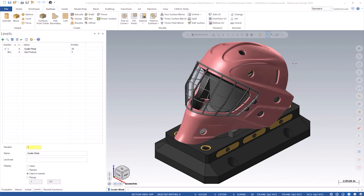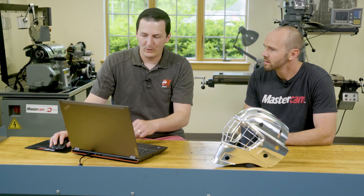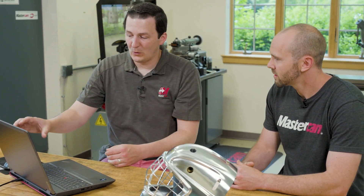For example, the biggest difficulty with mesh parts is the fact that they're essentially just one body. So when you pick this as your drive surface, the whole thing is your drive surface, so you may need to trim it and cut it up a little bit. That's no different here — I had to make a few different bodies out of this. But sometimes you really just don't want to program a mesh, and there are actually a few cool ways of turning this thing into a surface.